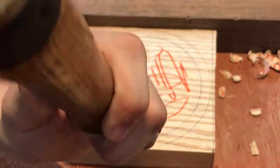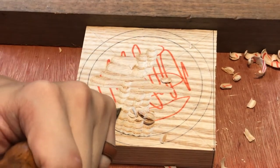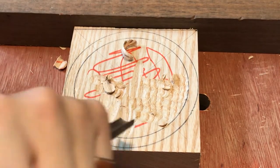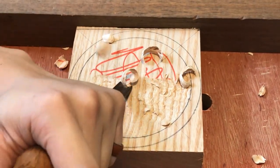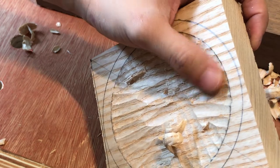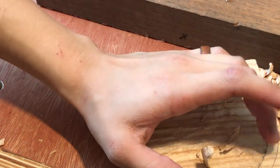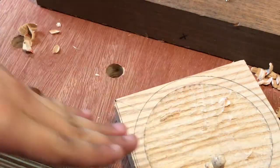Because of the crosshair that I drew, it actually divides the bowl quite neatly into four quadrants for me, and that's a good guide for when you should start turning the workpiece. You'll notice that I'm holding the gouge chisel pretty low down — not very high up on the handle — which allows me a bit more precision. I'm going to go around the entire thing and show you the result. At about this point I have a pretty defined rim going around, and I've barely started on the scoop in the centre yet, but at least you've laid down the perimeter of where you should be removing material. This will also lower the likelihood of tearout. You should keep working within the quadrants, slowly bringing it down in a radial fashion.